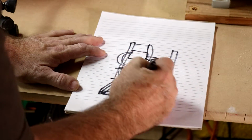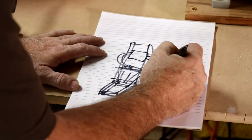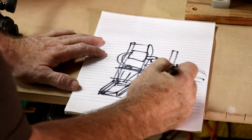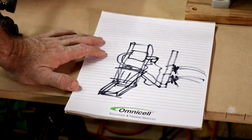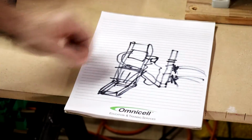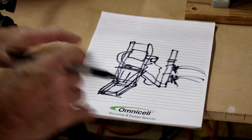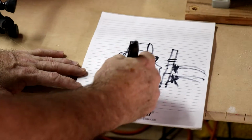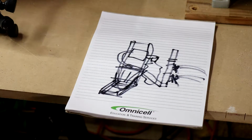And let's build another manifold with one 4-inch opening and one 2.5-inch opening with blast gates, so that we can pick which one of these we want. And we'll just cap that off. Hopefully I'll mount that on the side, or maybe even around on the back of this. That'll get all that up out of the floor. We'll have the footprint of a trash can. And that's just about it. Any questions?